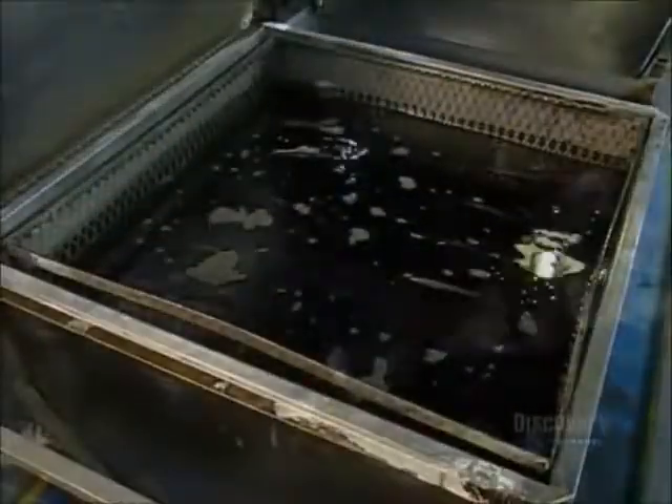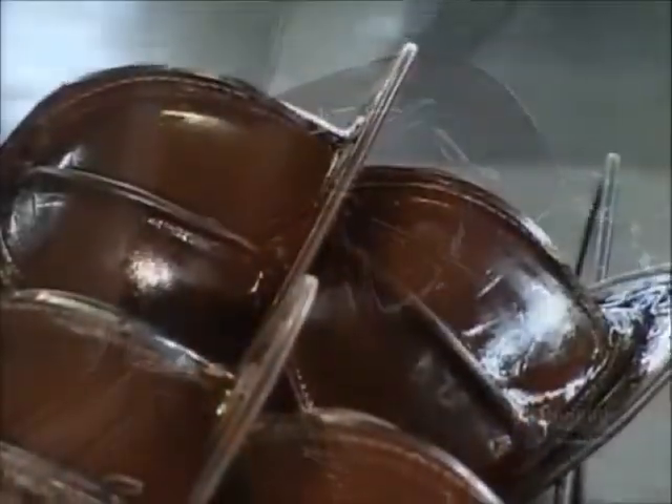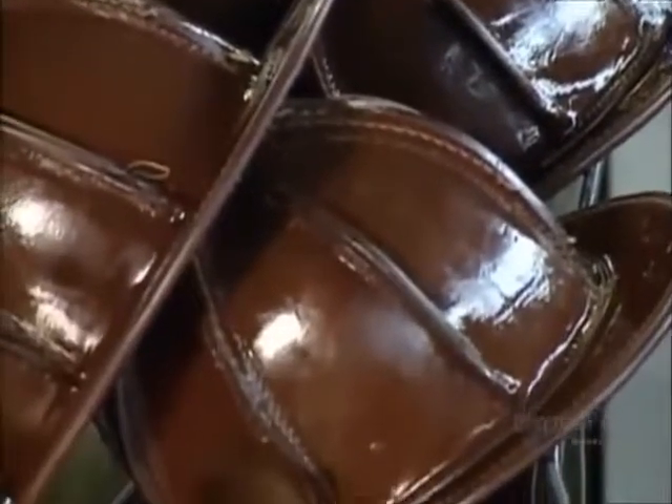After 55 minutes, they remove them and let them dry at room temperature for eight weeks. This slow drying process makes the leather about as hard as wood. Drying it mechanically would make it brittle.